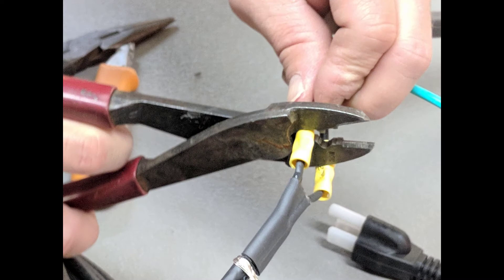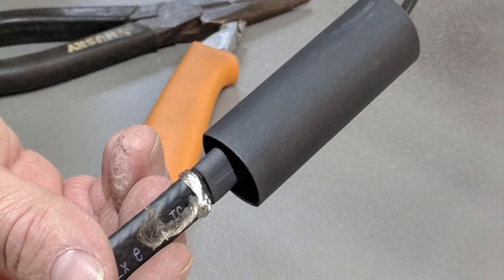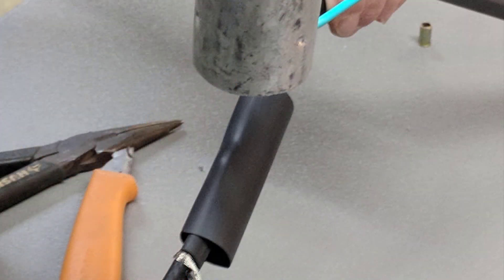A tug test is always a good idea, but don't tug too hard so you don't fully disengage the bus wire from the crimp. Fold the ground portion of the plug side back and push the shorter 3 inch, 3 quarter inch wide heat shrink tubing over the top of that and over the butt splice assembly. Apply heat until this inner heat shrink tube is fully shrunk to size and hot melt is protruding out of both sides.